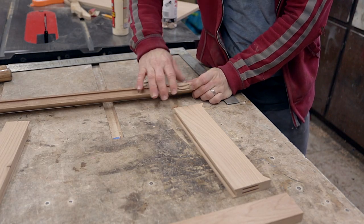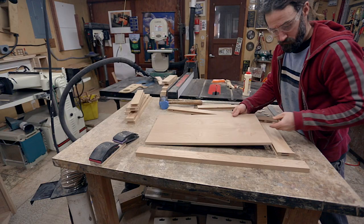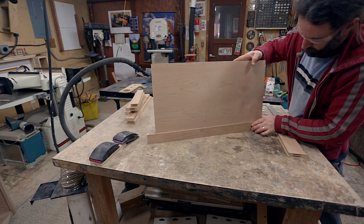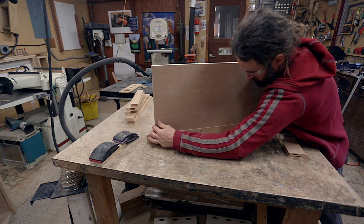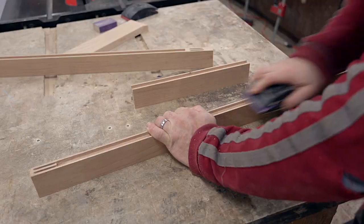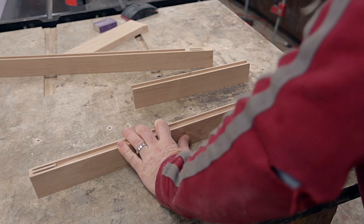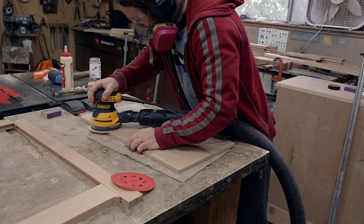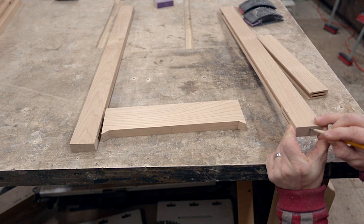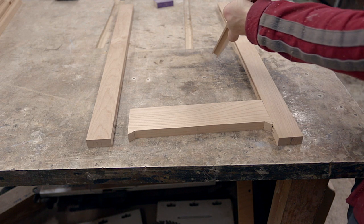I always do a test for the biscuits because sometimes due to varying thicknesses they won't fit quite right and need to be cut again. I then do a test for the plywood to make sure it fits in the grooves — I can sometimes sand the edges of the plywood a bit so it fits better, tweaking the groove and doing some test fits until it all goes together and can move just a little bit inside without leaving a gap. The next step is to sand the interior pieces now because it's really difficult to sand after it's all glued up — 150 then 220. I also sand the plywood. I mark pieces with little arrows to indicate which side is up so I won't mess up the glue-up.